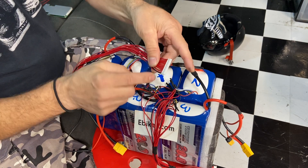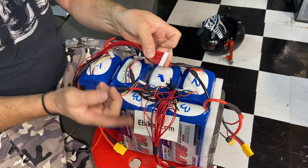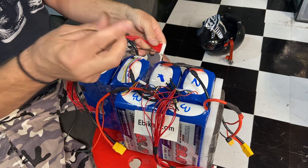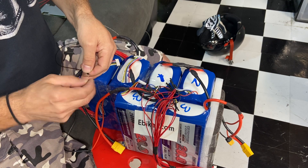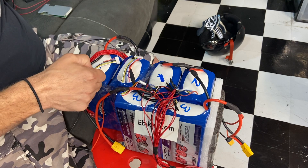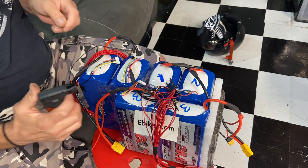You have to count these. I'm going to show you how to make sure that the order is correct before you plug into your BMS. I'm only going to do one to two bricks and then you just continue to three. Get the black wire to number one — I call this zero. Technically it's number one, but this just goes to the negative lead on the BMS.